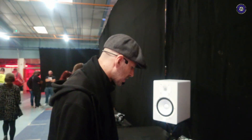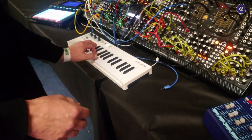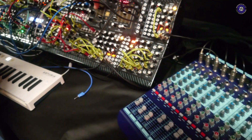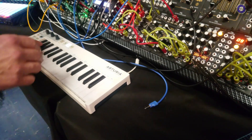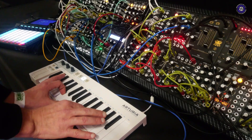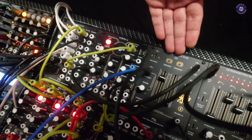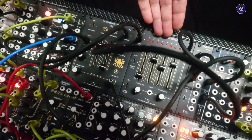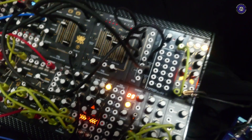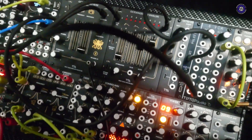Let's listen to the polyphonic — it's quite surprising and exciting. I'm not a keyboard player, mind you. That's a wavetable six-voice oscillator going through an eight-voice analog filter controlled by an eight-voice analog envelope, going through a six-voice VCA which we will replace with an eight-voice VCA. All of them have the polytip connectors. We also have OctoIO which can split the polytip signal into separate mini jack outs — eight mini jack outs.